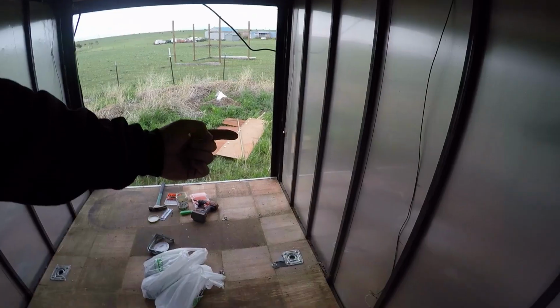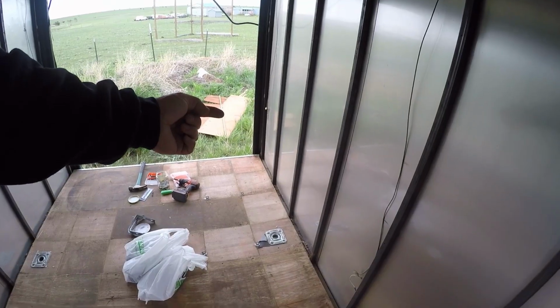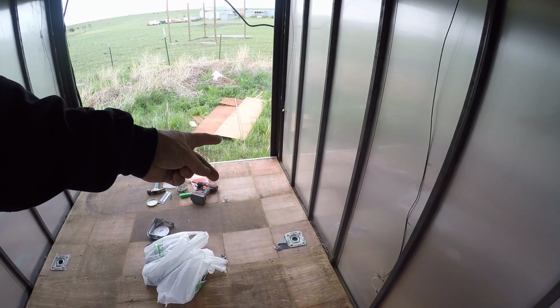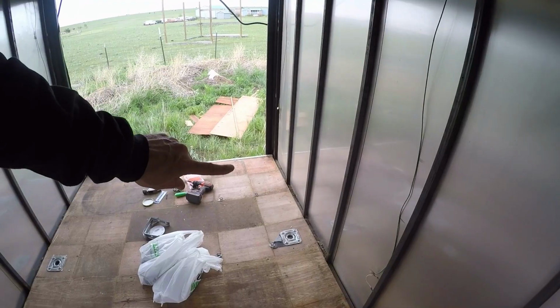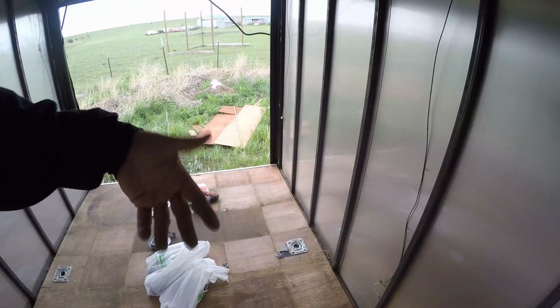I'll put a shore power pigtail connector out the side of the trailer right there, so that I can charge my solar system from that. And also I'll have one outlet in there that is household, for, I don't know, an air conditioner, whatever. If I'm going to run shore power to it, I may as well put an outlet so that I can access it, right? And then again, that'll charge the 12 volt system through the controller. And I think that's it. I don't think I need any other electrical run in here.